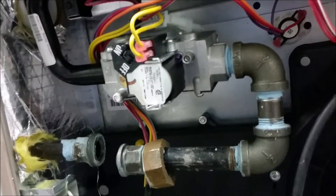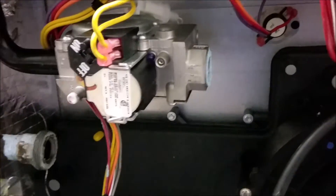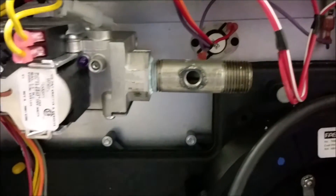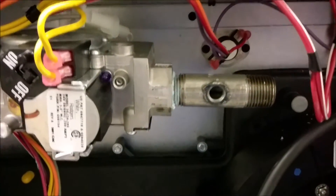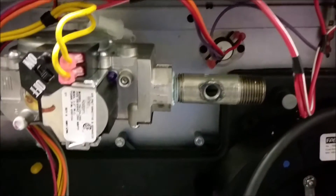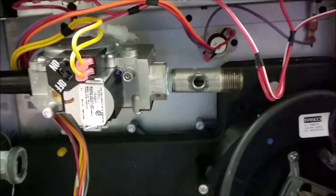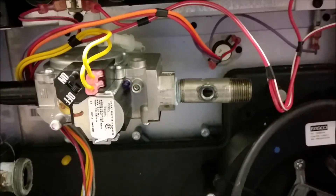Basically this is all the wiring you have to deal with when you take the gas valve out, and then we'll rewire some things after we put the pressure switch in. We've taken the inlet piping out and installed our tap nipple for the pressure switch. One important thing — the tapping has to be facing out horizontally, not vertical. Not all furnaces I convert to LP need a pressure switch, but on this specific one we put one in. Always refer to the instructions and follow every single step.